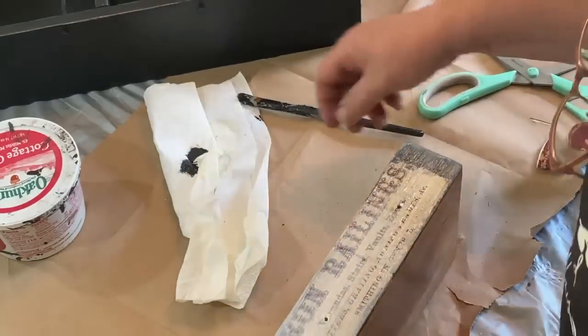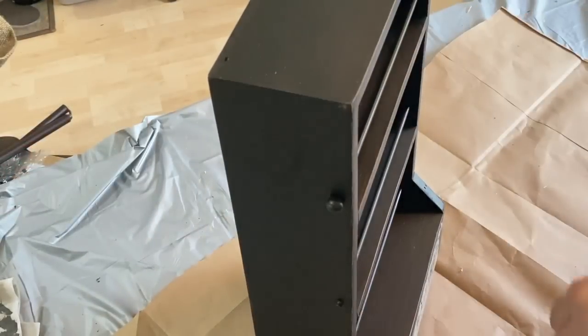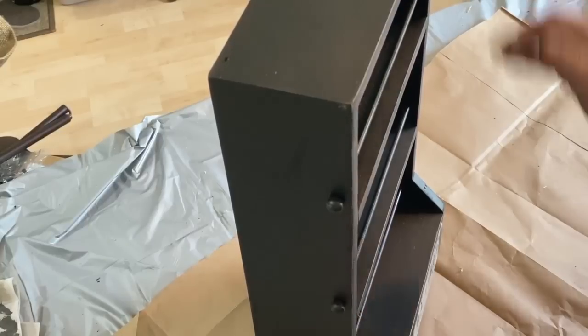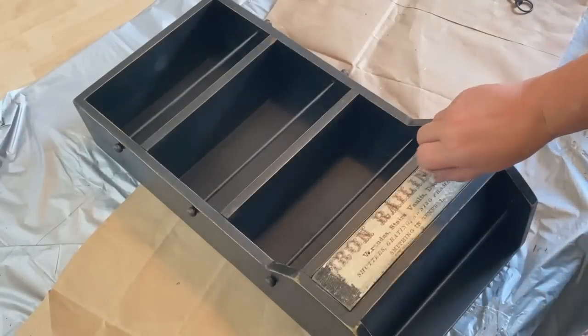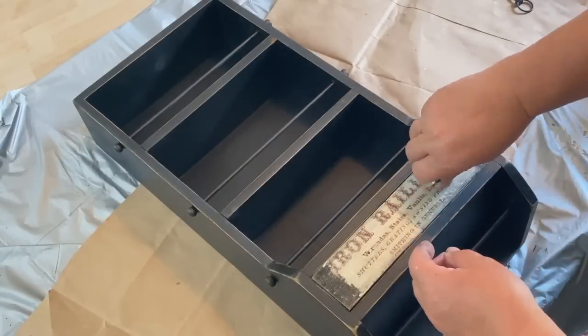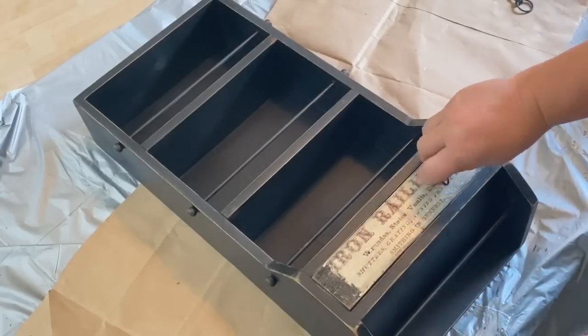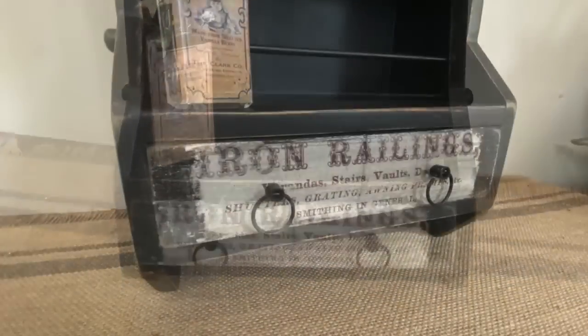Then once that was done, I took a little bit of my antique wax mixture and went over the edges — I wanted the plaster paint areas to be dulled a little bit — and also went over the ad so that it was antiqued and aged even more. I'm just poking with my scissors the little holes where the knobs would go, and I'm taking my Mod Podge to seal the top and make sure that the ad decoupage paper stays down. Now while that's drying, I'm putting my knobs back on — I did spray paint them black, then put the ones in the drawer. They just screw on the front.